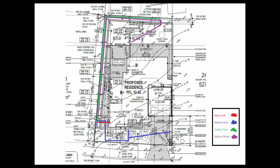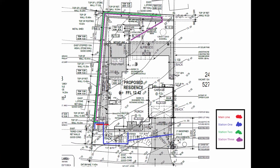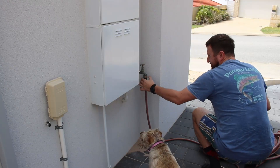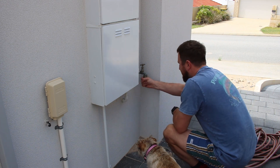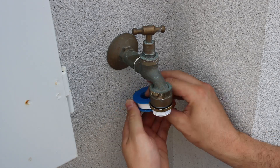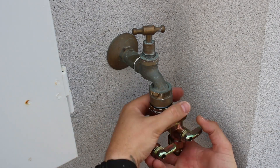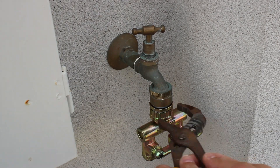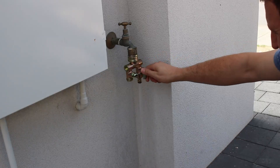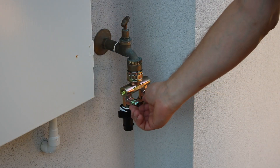I had a fairly good idea of how I wanted the system to work, but it helped to make up a small mud map on an aerial view of my house plans. I don't have a dedicated mains connection for the retic, so I'm using some adapters to tap off a garden hose outlet. This part from Holman is a two-to-one splitter where each side has its own shut-off valve — so I can still have a hose connection and on the other side adapt it into my 25mm retic piping using a 25mm black plastic barb.